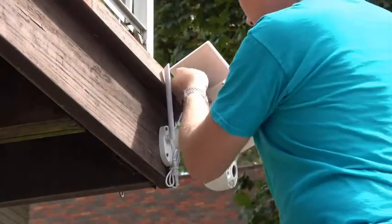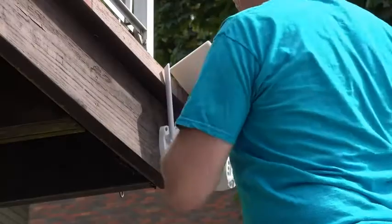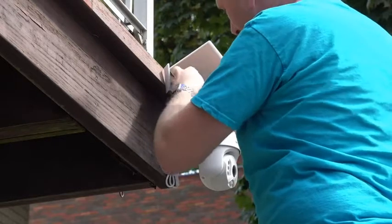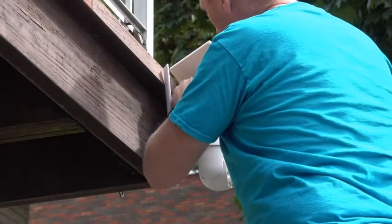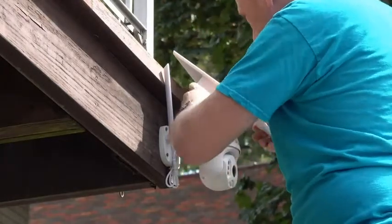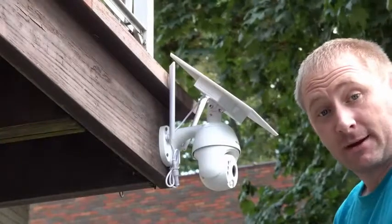I'm going to go ahead and tighten this. Let me take a photo. That way you guys can see at least what it looks like. Put the rubber seal back on. And make sure this is obviously a rubber seal that's facing upward. So take your time. Make sure this one gets back in there properly. Because, you know, gravity is against you on this one. We want to make sure that no water gets in. There we go. So now I'm going to tighten these back down. And then I'm going to tighten this guy down. Let's start pairing.